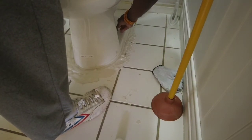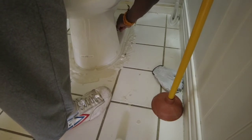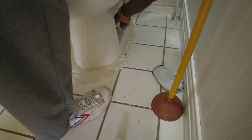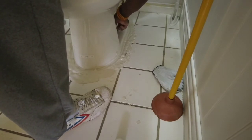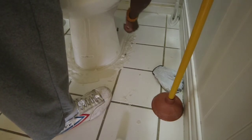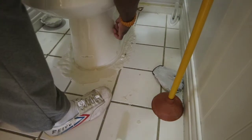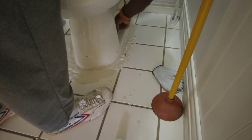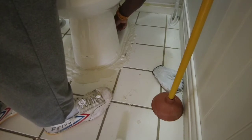Another thing, like I told you, you don't want to over tighten any of these bolts. You want it snugged and it'll hold well. You don't want to horse it, because that's when you actually snap the flange or crack the bowl. But even more to the point in this particular case, if you over tighten it, then that plastic piece actually flexes and you won't be able to clip on the covers for it.